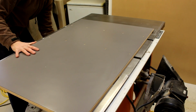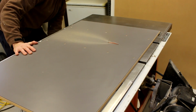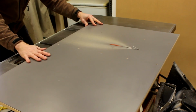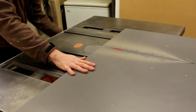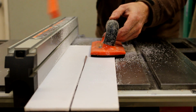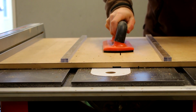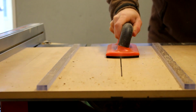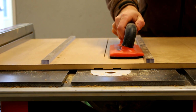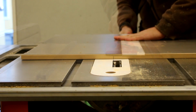To make the first cut through the base, slowly raise the blade. And push the sled forwards, making sure you don't go all the way through at this point. I then cut the inserts out of 1/8" acrylic. Using a dado stack, I cut the relief that the insert fits into. Be sure to test that the fit is flush.